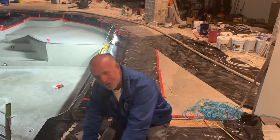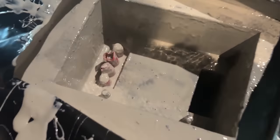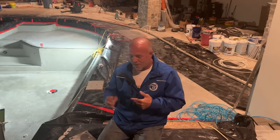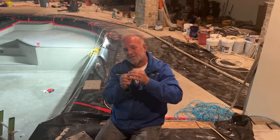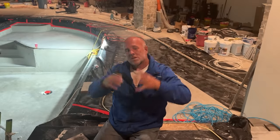This mesh right here makes me super happy. This is a tube that goes to the basement. That's the dry side. This side right here is the wet side that's got all these red tape balls at the top that are plugging the four pipelines that go all the way to the bottom of the pool. We just poured just about 6 gallons of a two-part liquid rubber that went into the 2x4 stainless tube and went around all the four stainless steel round tubes. So I had a square tube and then four round tubes. We filled that all with solid rubber, so it's permanent, done.